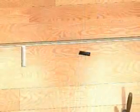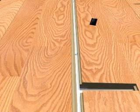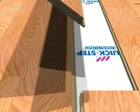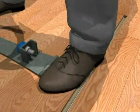Step 5. To remove the plank, make sure that the tongue side is showing. If not, use the Unifix to expose the tongue side. Now the plank you want to replace should be open on 3 sides. Replace the damaged plank with a new plank, making sure to click the groove side in first. When closing the plank's back, the long side should be closed first, then the short side.